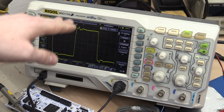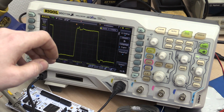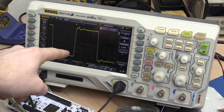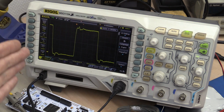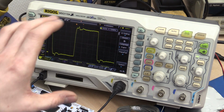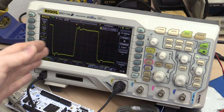But again, the voltage spikes that you saw at the far end of the cable with no termination, that could damage the equipment. So that's one thing to think about also. To solve that, we could also increase the rise time a lot, so that it's a lot more than the time it takes for the signal to reach the end of the cable, and then this effect will pretty much go away also, but that will limit the data rate a lot.